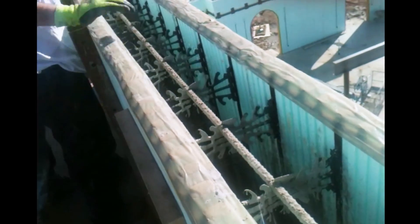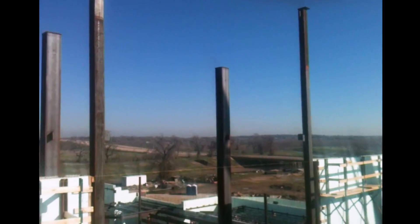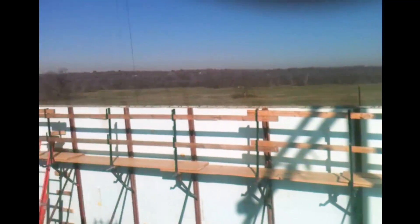In case you're wondering about the verticals, they are one foot below this level. This section goes up another 16 feet or so. We'll pour about to walkboard height to get the required overlap of the verticals. Here comes the concrete again.